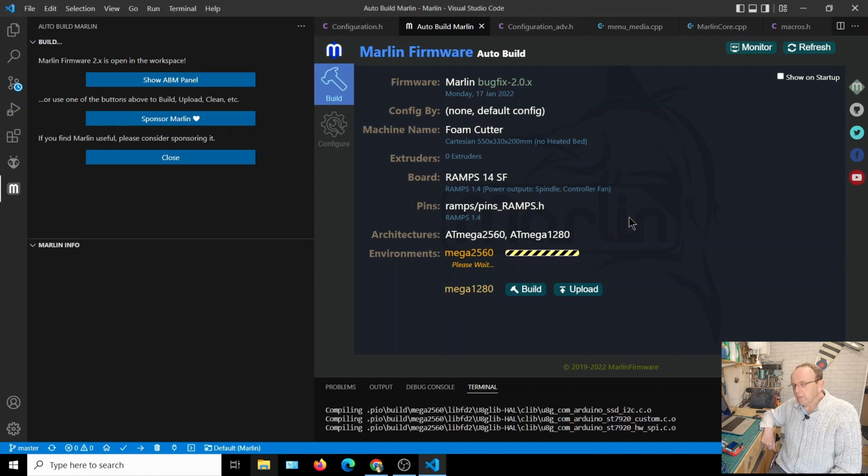And so far it's looking good, we've got no errors. Now if you do get any errors, the thing to do with this is go back to the very first error, because normally the other errors follow on from that. So when it gets one problem, it just compounds the issue. So if you do get any errors, try and see what that error is. And the best thing to do is just copy that error, Google it and see what it comes back with. Normally it's something quite simple. The common thing is leaving out semicolons, or if you've made a change.